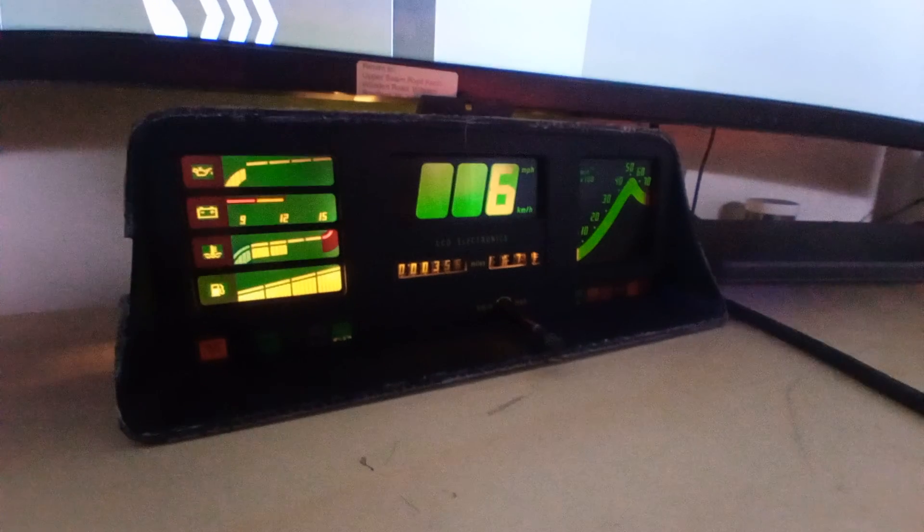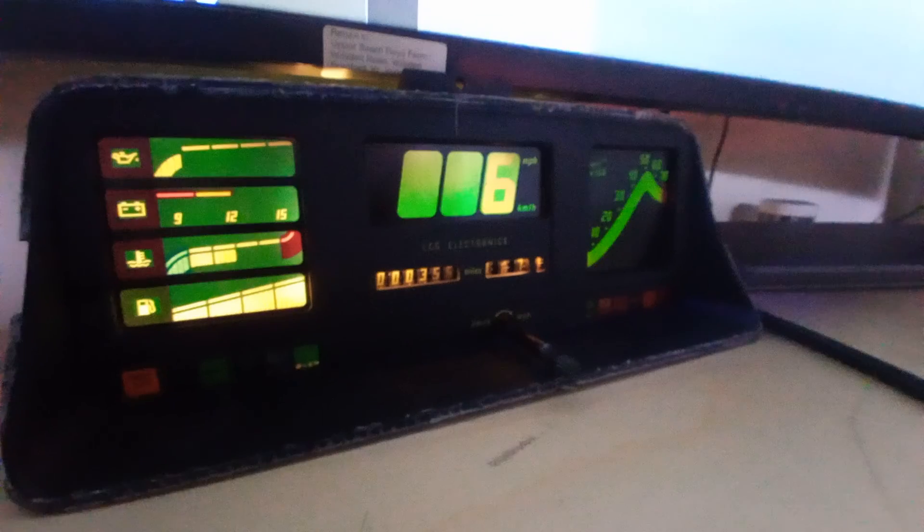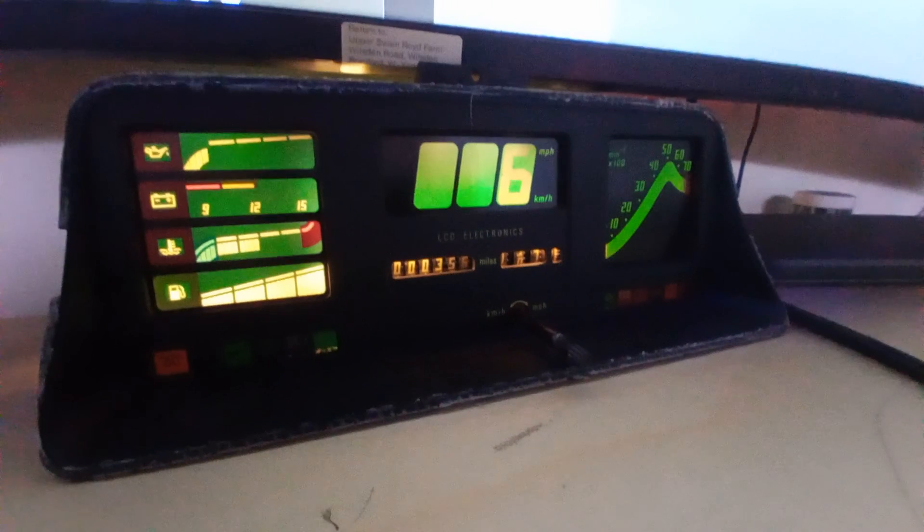There's an ESP32 that's interfacing directly with the LEDs. We had to basically write a driver just by addressing each individual bit, and bitmasking to figure out what bit did what.